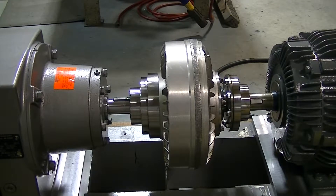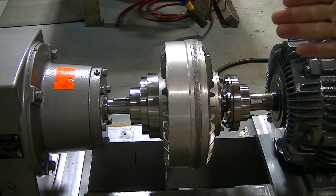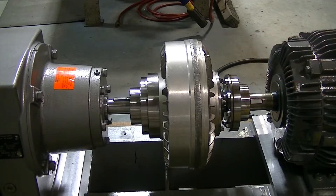Well, Tim, thanks for explaining the fluid drive coupling to us — we're interested in how it works and why. So on your screen you'll see this fluid drive coupling. It is a type of coupling that connects a gearbox on the left side and the motor shaft on the right side. We're prepared to start it up, so when you watch this fluid drive coupling you'll see one shaft winding up and then all of a sudden the other shaft will catch up.